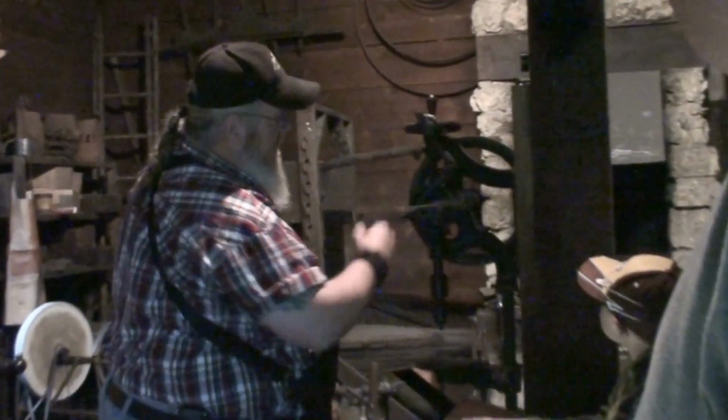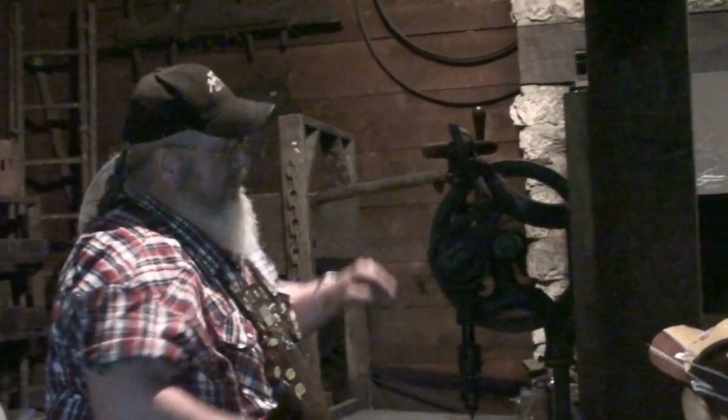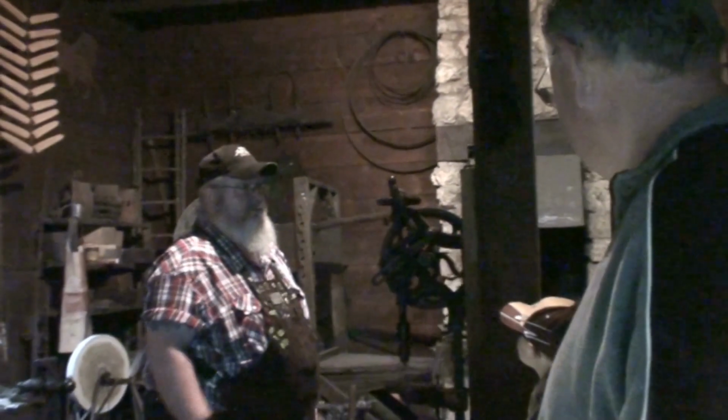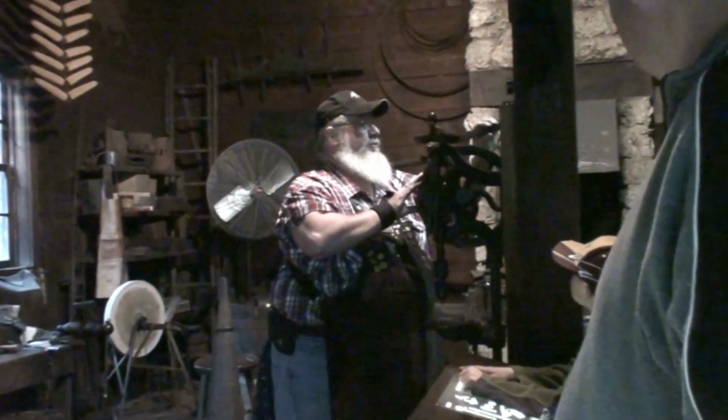All right, 2.5 times because of that gear ratio right there. Every time the little cam loads up, flips that lever up top on that ratchet wheel, and I'll speed that up and see, that's what advances your drill bit down any material. Everything still works on this old drill press. That is a fully functioning, working drill press.